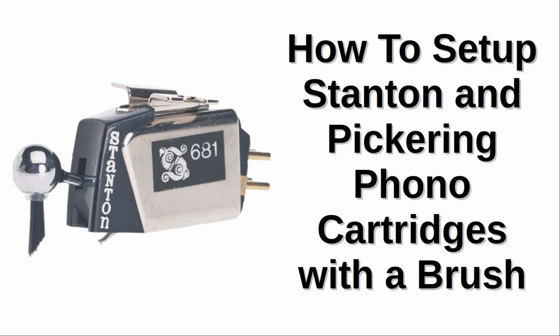This doesn't have anything to do with the tracking of the stylus. It has to do with the fact that it's just overloading the coils and saturating them, and you get a lot of very nasty distortion. And of course, there's nothing that you can do about that at all.